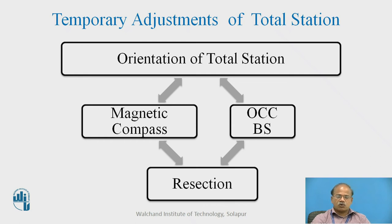Some of you may be familiar with the orientation of the plane table — this is similar to that. In the plane table, solving the two-point problem or three-point problem is used; in the case of the total station also we can do it the same way, or by using a magnetic compass fitted at the top of the instrument. We can make sure the magnetic needle comes exactly towards the north-south direction, and then ask the instrument to memorize it as its starting or reference direction. However, magnetic north is rarely referred to in total station work — an arbitrary meridian is most often used.